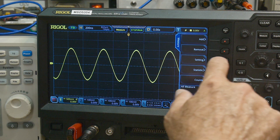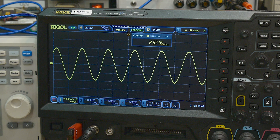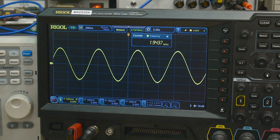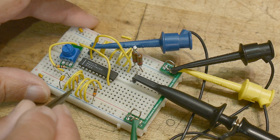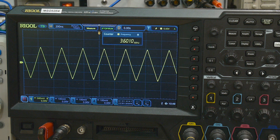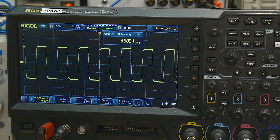We're at 2.3 megahertz. Let me change the frequency — we can take it up to 3.6 megahertz and down to about 1.89 megahertz. I just grabbed a resistor off the shelf to vary things. Now let me change the digital logic on those two pins. If I set it to triangle wave — there you go. And if I change it again, we get a square wave. So you just program those two bits and you get square wave, triangle, or sine.